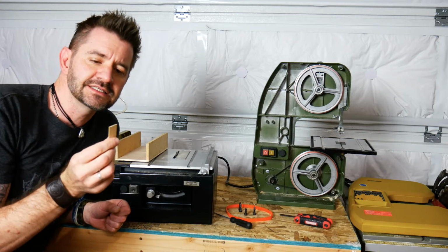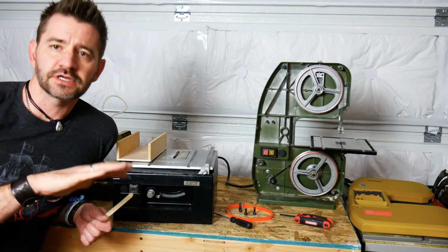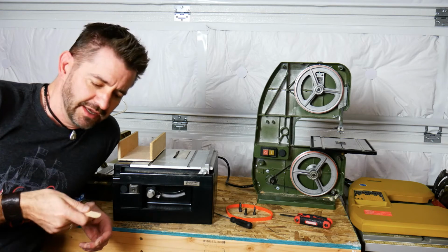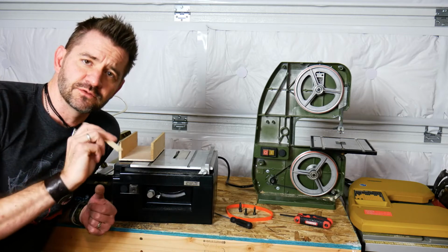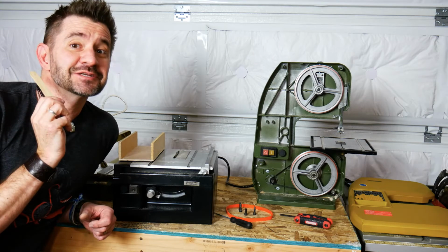So when I did this for the last set, I did all the flooring in the bedroom. What I did was take these, and a handful at a time, like 2 or 3 at a time, I would hold it up to the disc on the belt sander and just grind it till it was about square, and then flip it over to the other end. So this is going to be nice. This is going to be really nice.